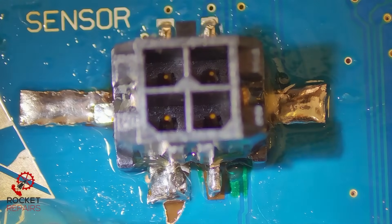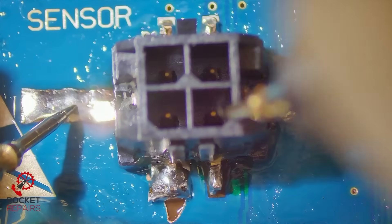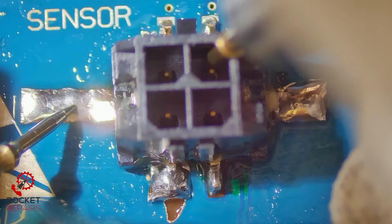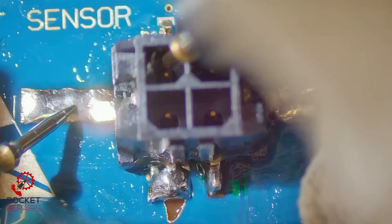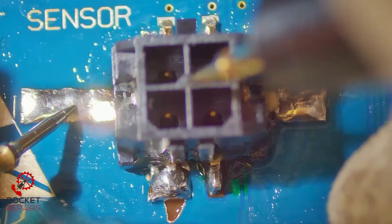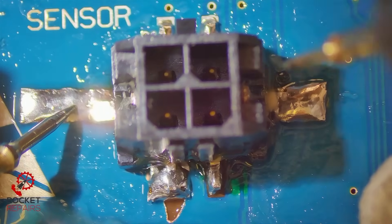We quickly measure in diode mode. Ground is on this side. Because the board is flipped, this should be the positive pin — so we should be reading 0.7, which we are. We get 0.7 voltage drop here. This should be a data line and we get 0.74 in diode mode. This should be ground — which it is. And this should also be ground. So we don't have any of these touching, there's no continuous path between them — this should be all good. That connector is now solid and fixed. Hopefully another happy customer. I'll speak to the customer and make sure that everything works, and you'll see a pinned comment on this video as soon as they reply. Thank you very much for watching — if you enjoyed, like and subscribe, and I'll see you in the next one.